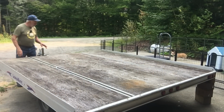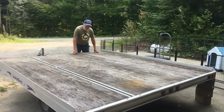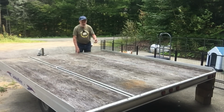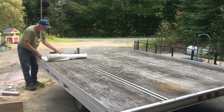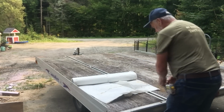And I spent all that time figuring out the gable ends and the width so that I would know where to put the floor. I had mentioned I'm going to make it so it can slide right off the trailer if wanted. It's going to sit on a sheet of plastic, and then there'll be just OSB on the bottom, and then 2 inches of foam and 5/8 tongue and groove Advantech on the floor. Then I'll do a perimeter all the way around of 2x, so there's something meaty to grab into. Well, let's get at it. And plastic. I think I'll start on this end. By the way, I leveled the trailer so it's all set.